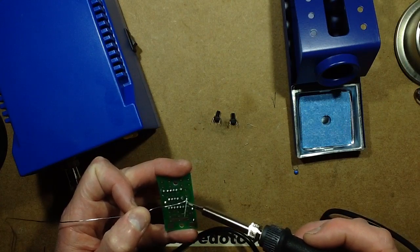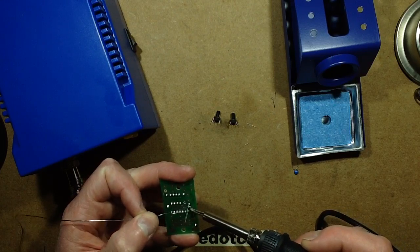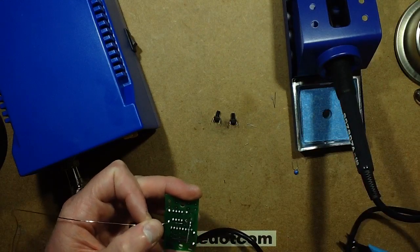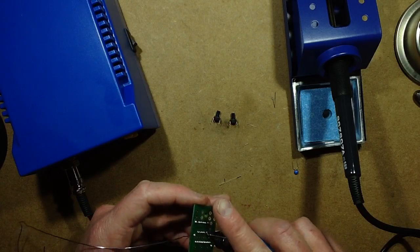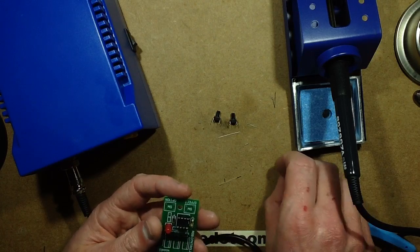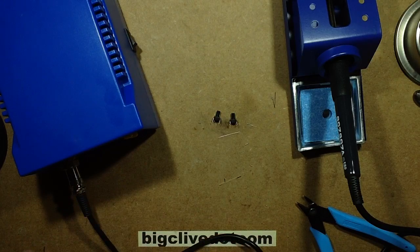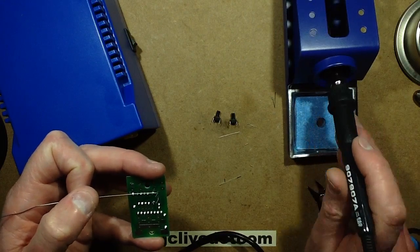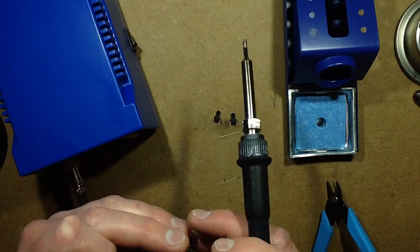That is one downside to when they try to make the electronics too fancy, it just makes it unserviceable sometimes. It's okay if something like a triac goes, it's easy to change, but if the processor goes, it kind of renders the equipment inoperative. So many times you see things like an elevator controller where they've used a dedicated PLC, and it's quite an old elevator, and the PLC just suddenly one day loses its program. And if the company's gone out of business, that one component renders it useless, unless you can get someone to reprogram that PLC, but that would be like designing all the control system for the lift. So sometimes you can overcomplicate things.